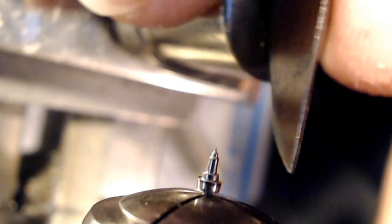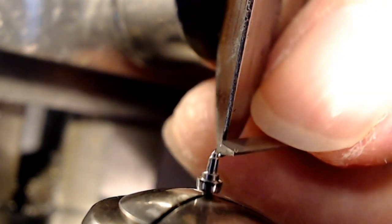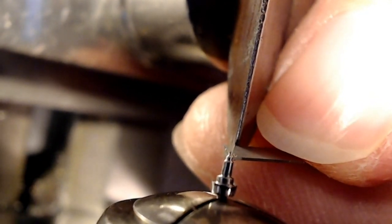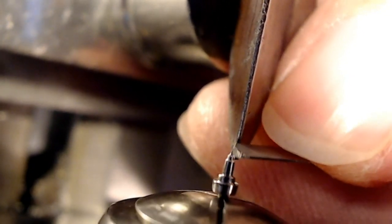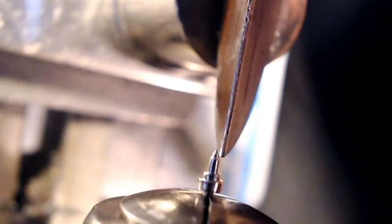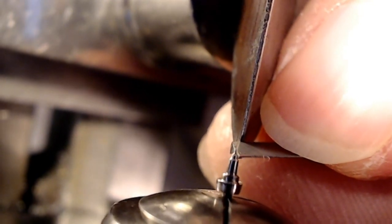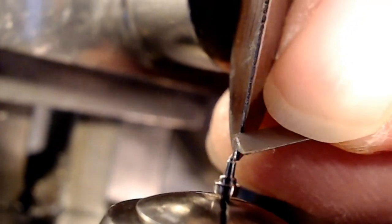Let me flip this up so you can see — there's the flip-over tool rest. The graver here is a flat graver and it's two millimeters wide. That just takes material off — takes a little tiny bit off with no issue at all. Then I go to a rounded-tip two-millimeter graver. That just helps me dome that pivot, rounding it from the tip of the pivot around here with this rounded-tip graver coming in at a bit of an angle.